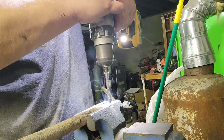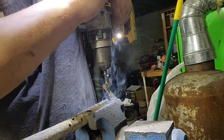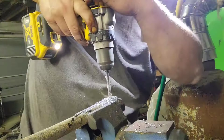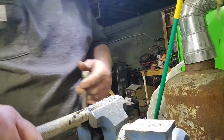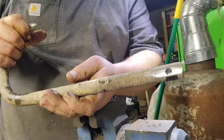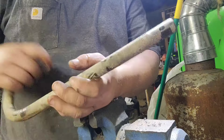A couple drops of oil down in there keeps your drill bit from getting hot — I'm sure everybody watching this knows that. Don't want to force your drill bit; let it do the work. There we are. It's a little off center but it'll be okay — thick enough to do whatever we're going to do with it. Using a safety chain, there's not a lot of pressure on it, but I'm going to use a pretty big chain and try to get a shackle through that. I'll come back after I get some more parts tomorrow and finish this video up.